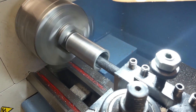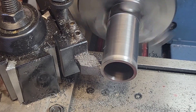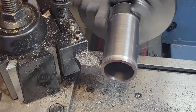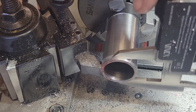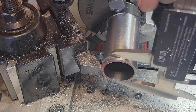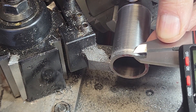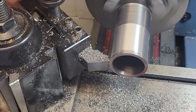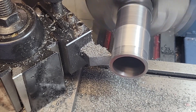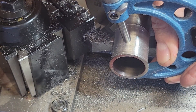It's now time to turn our attention to the outside diameter. I use my trusty razor blade to establish the zero point for the carriage DRO, and I touch off on the outside of the workpiece to set the diameter of the cross-slide on my DRO. I'm going to machine the lip first, and I really need a left-handed tool here. I have to use such an extreme angle on this right-handed tool that I've got to be very careful not to run into the chuck. I'm taking some initial measurements to ensure I don't cut too deep before I have my DRO absolutely dialed in. Then I turn the top half of the cylinder sleeve to proper diameter — I'm only cutting the top half because my cutting tool doesn't clear the chuck. I'm going to have to stop, reorient the cutting tool, and then machine the bottom half of the outside cylinder after recalibrating the DRO.